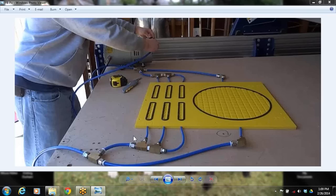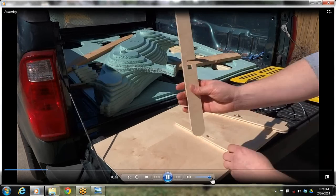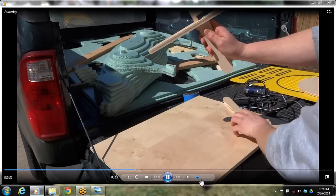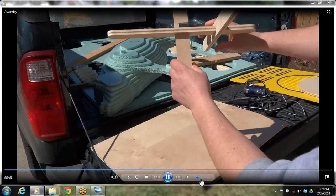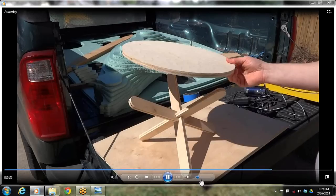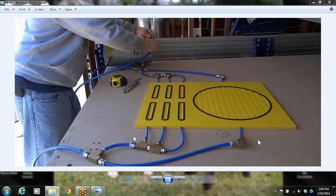This is a little individual jig that I can take anywhere — from a desktop to cut on, to a 4x8 machine. The project we're going to create is a little puzzle table. We're going to create the jig that holds all these different pieces in place. Why is it nice to have a vacuum jig? One, I don't have to have tabs. As soon as I'm done cutting, I can turn the vacuum off and pull those parts off with no additional sanding or cleanup needed.